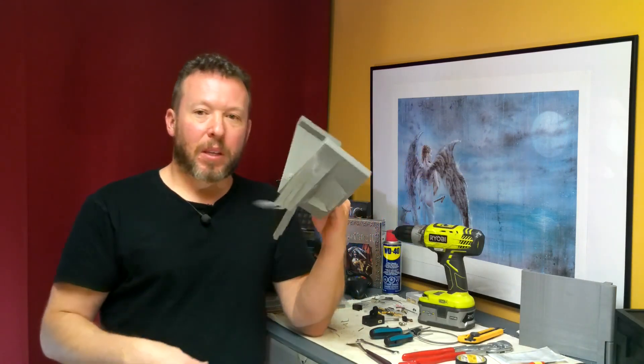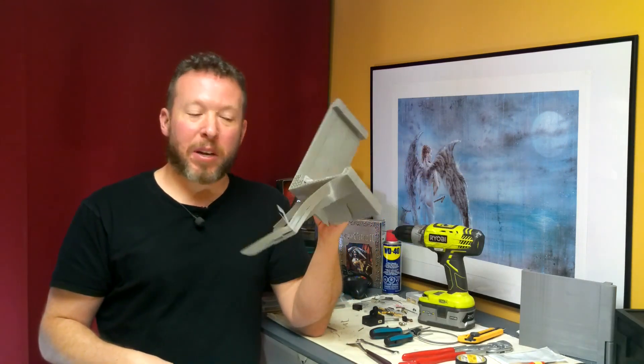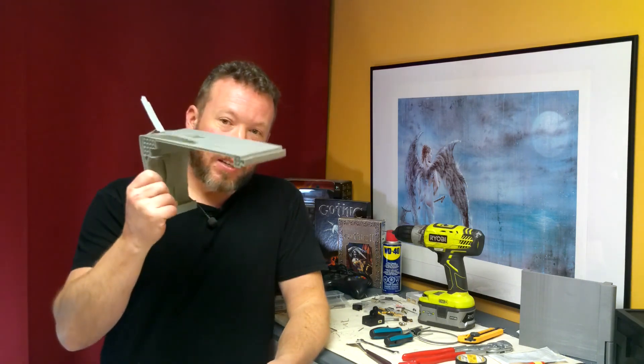Let me tell you what the fuss is all about. As I mentioned in the last video, I'm currently trying to build this modular enclosure for 3D printers. And I ran into several issues — from excessive delamination to clogged up nozzles. The delamination is probably caused by that drafty window behind this curtain and our current cold snap. When at night the heating system turns down and cold air gushes in from that basement window, PETG really doesn't like that.